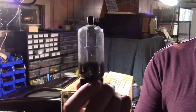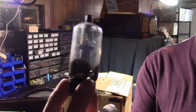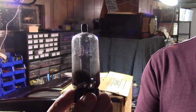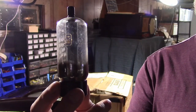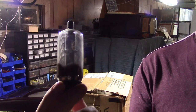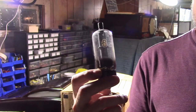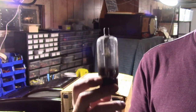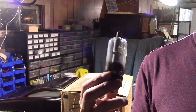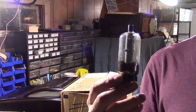Because of the mask and the phosphors used, they needed a lot more voltage to produce a watchable image, and they needed to regulate it so the colors wouldn't fade as the brightness varied. Enter these — this is actually a triode, a special kind of triode that can work at really high voltages. This is what they used to regulate it, kind of like a Zener diode, sort of. The high voltage produced would be in excess of 30,000 volts, and this would regulate it down to 22,000–25,000 volts. These could produce x-rays. I've read some anecdotal evidence — I don't know what sounded the alarm that it was actually an issue, but once it got out into the public, people got scared, it was promoted and talked about a lot.